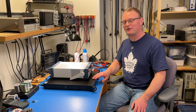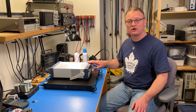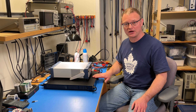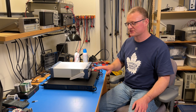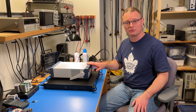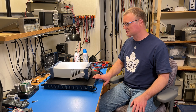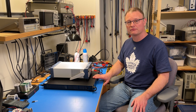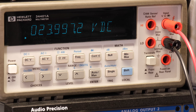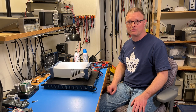Let's take a look at the performance of this power supply with a static load. This is a BK Precision 8600B electronic load; it will draw 6 amps from the power supply, limited to 150 watts. I have set the output voltage to 24 volts — 24 times 6 is 144 watts, just below the limit — and I have set the current limit to 6.1 amps. The output voltage is 23.997 with the load off, and with the load on it reads 23.996. So it drops by a millivolt. That's pretty good, and that is measured directly at the output terminals.